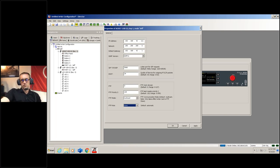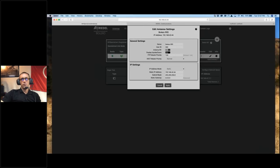Is there a list on your website about recommended switches to use, brands and models you've tested? We hesitate to put out a whitelist, because we have no control over the software that those manufacturers put out. So you need to have a discussion with the switch manufacturer and bring us into the discussion. We definitely help, as best we can, ask the right questions. Is it a PTP aware switch? Does it do boundary clock, or does it do transparent clocking? At the very least, it needs to be a managed switch.